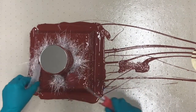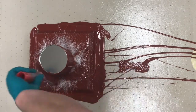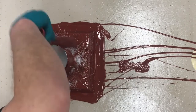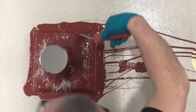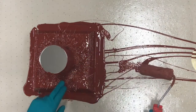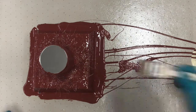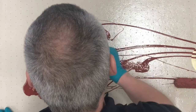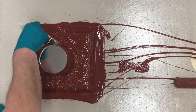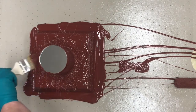As you can see now, as I start to do the pipe, rather than waiting five to ten minutes for the matting to break down, you'll be able to see that I'll be able to bed it in very, very quickly — it actually breaks the matting down instantly. From that stage I can bed it in round the bottom of the pipe; I don't need to wait for it to break down. As you can see it beds in straight away, which is a massive bonus speed wise — it will cut down labour times.